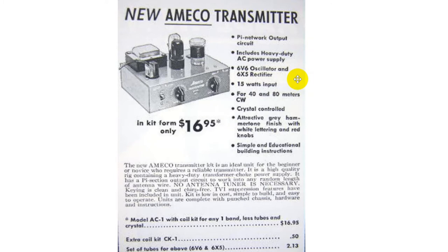Back then, the legal limitation on ham radio was 1,000 watts input. That's changed now — it's all in PEP, peak envelope power out. So we're probably going to expect half that at most on output. This is a CW-only transmitter. I plan to use it with a software-defined radio, so we'll see how it goes. It is crystal-controlled only.